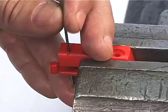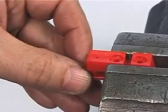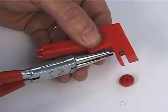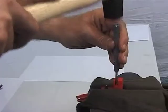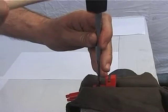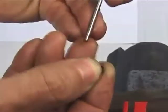Fasten the valve body in a vise and extract the pin, figure 38, and the lever for inlet opening, figure 43. Use special pliers to remove the push button, figure 44. Put a cloth on the vise and fasten it together with the valve body. By means of an extractor, make both balls and both valve pistons, figure 41 and 46, exit from the rear side of the valve body, taking care that the O-ring, figure 45, is inserted onto the extractor.